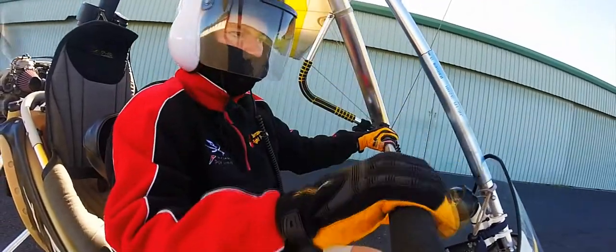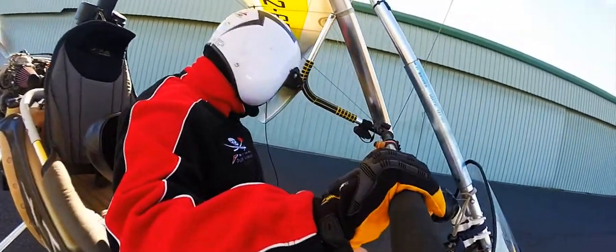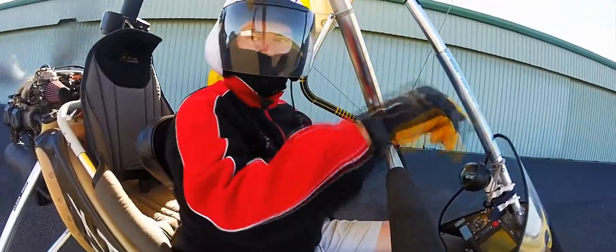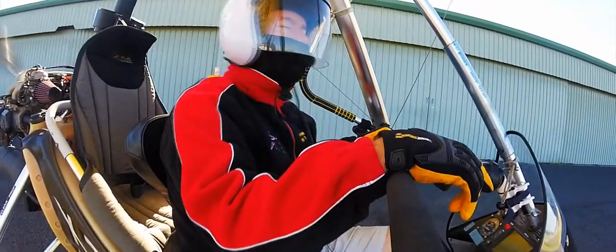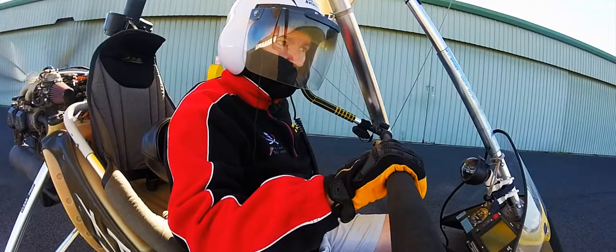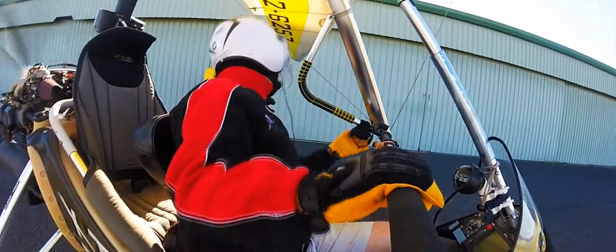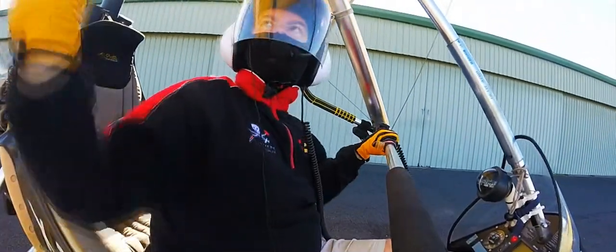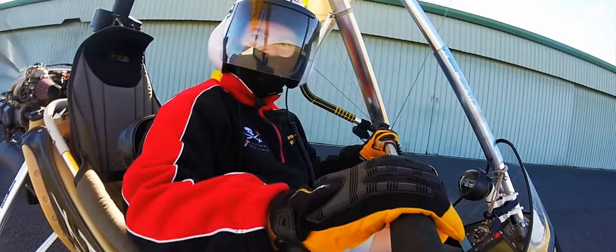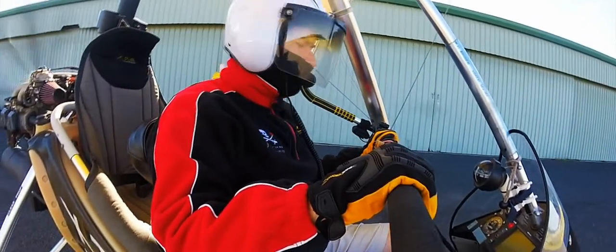We use a thing called Twimpfisher as I said before, which stands for Throttle, Wings, Wind and Wires. We're looking at the wind — runway 12 is preferred. Wires of the wing not twisted, everything looks good. Mixtures: we can probably shut the choke off now because it's 35–36 degrees. Mixtures and pins — we check all the pins around the airframe. We've got these ones on each side, training bar pins, the hang bolt pins, safety pins — all good. Check our trim, I normally leave it at maximum speed. It's a Streak 3B wing.